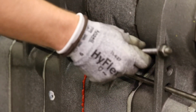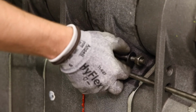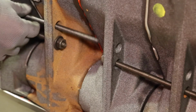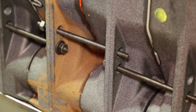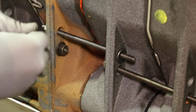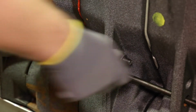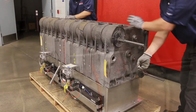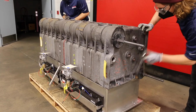Place the 7 3/4-inch tie rods through the lug holes at the upper and lower nipple ports. Thread a 3/8-inch nut and washer on each end of the tie rod and tighten the nuts. Do not over-tighten these nuts; they should be hand-tight only. This will allow for thermal expansion. Loosen and remove the draw rods.